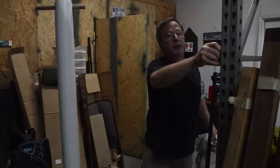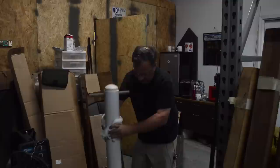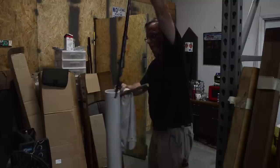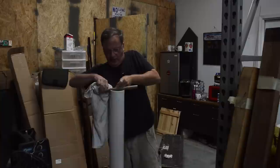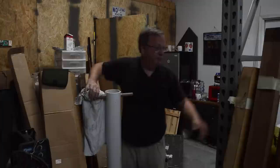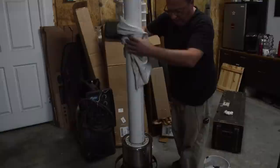So what I'm going to do now is take this steamer off the pot. It's boiling. I'm going to remove the cap, and this is my little crossbar here. And we're going to put the barrel, if I was a little taller, it'd be easier. Put the barrel in there, hang it. All I've got is a clothes hanger that's been straightened. It goes through the muzzle and out the breech because most of the steel is in the bottom. You want that closest to the steam. Okay, recap it. Protect your hands. Pipe back on there and bring it back up to steam, 10 minutes.